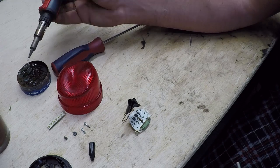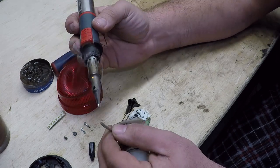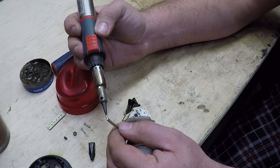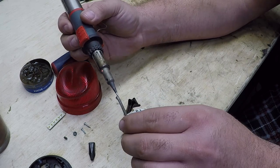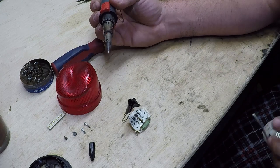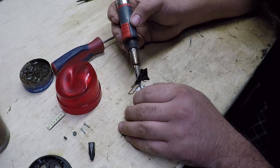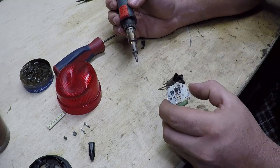What I just did is I put the tip of the soldering iron in the flux, and you can see it shines it up. We're going to get just a little bit of solder on the tip of it if it'll melt this big stuff. The stuff I was looking for was tiny for soldering circuit boards — this stuff's for like soldering your water lines. Just put a little bit of solder on there — that's called tinning the tip. What that does is it helps conduct the heat from the soldering iron into the joint, because we want it to happen as fast as possible. The reason being is we don't want to overheat all these little components. Okay, so we got that put back together. And I can smell the burnt superglue, so I don't know if that's good or bad. Hopefully burnt superglue doesn't kill a person.